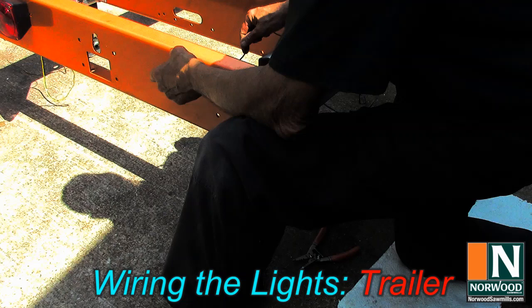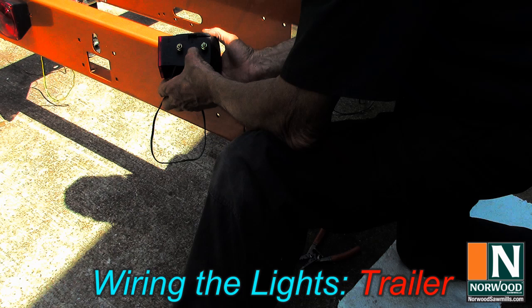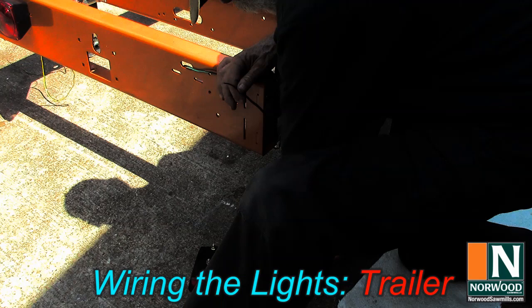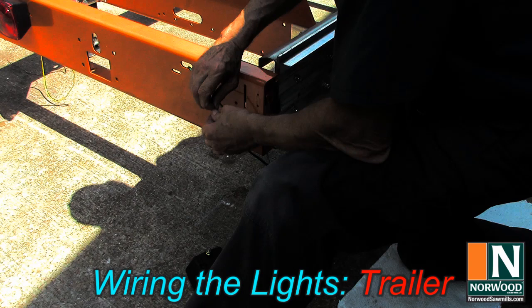Right, or what they call the curb side in the instructions, goes on the right side of the trailer. You can tell the right-hand turn signal pretty easily because it's clearly labeled RH, right hand, and it says stop and turn green. So that tells us that we are on the correct side. We've got the green wire, and we'll hook it up. Strip off about a half inch of insulation. Twist it up real well.